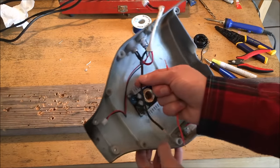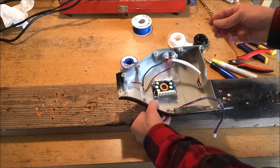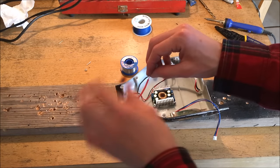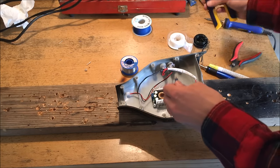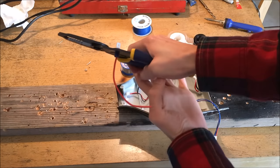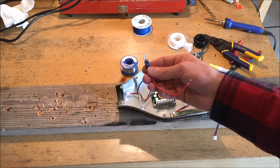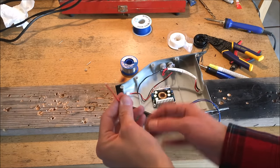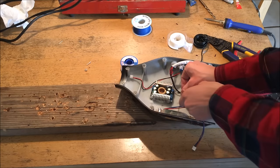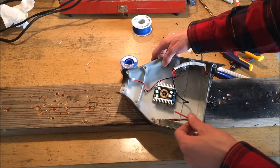Now I've connected the negative and heat shrunken it into place, so this can reconnect to the motherboard and provide the negative rail to this board. I'm also going to set up the positive interconnect — I'll take the male end of this contact connector clip, slide it on, line up the crimpers, and crimp it in place. This is going to mate up with that earlier connection receiver that we soldered to the battery terminal before, and this part is going to connect into the connection to the buck converter in addition to the negative terminal of this supply line.